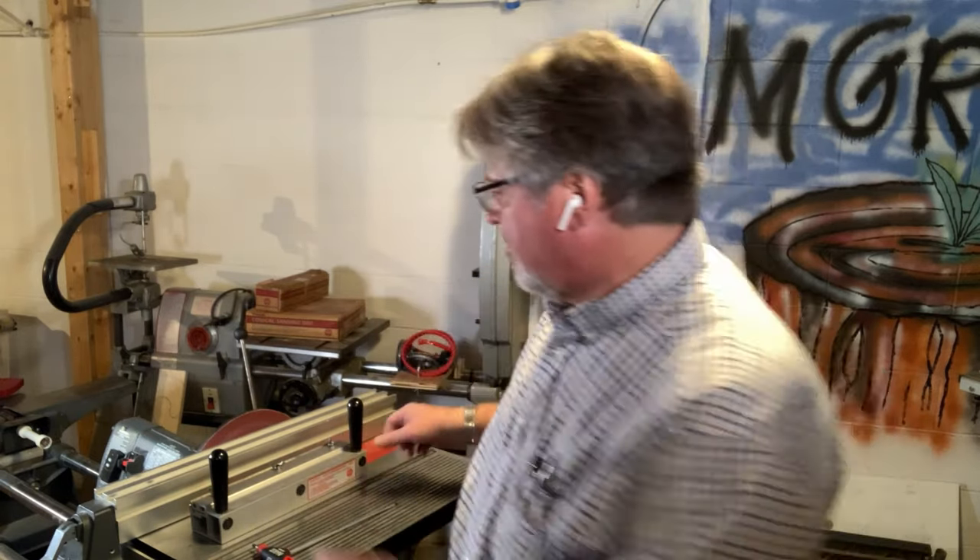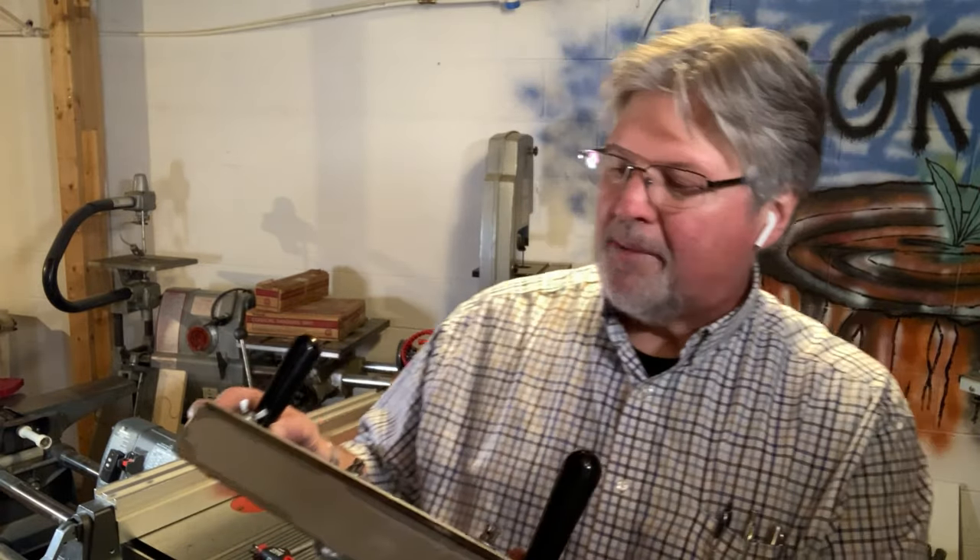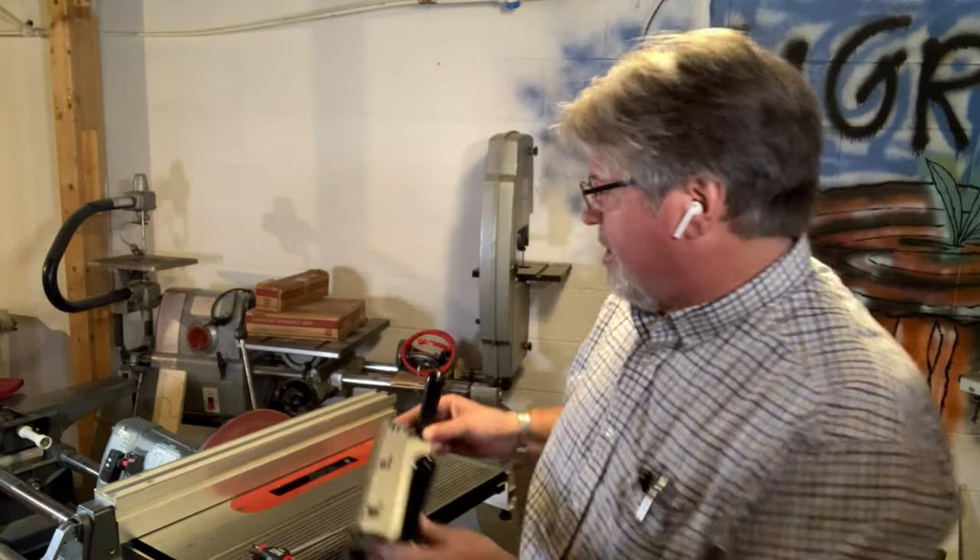This process differs slightly if you're sharpening your 12-inch Shopsmith planer knives: you sharpen all three knives with the machine at whatever setting you have, and then if you lower the table or move the quill, you run all three knives through again. This keeps everything properly balanced and ground to the same height. But with joiner knives set up together, all three are done at once — really slick. That's the conical sander for sharpening. If you missed the conical sander for wood edges, follow the link in the video description. Channel members, you guys are awesome — we'll see you midweek for our follow-up. Make it a great day!